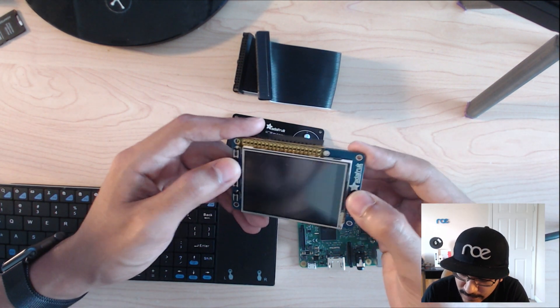Here's the Pi — I'm going to disconnect the power since we safely shut off and plug the Pi TFT into the GPIO headers — just snap it in like that. I still have Ethernet plugged in so I can SSH into it. Make sure the card's still in there. I'll plug in power again and we should be able to see it boot up. We'll get a white screen for a second, which is totally normal, but we should boot in about 30 seconds or so. Now it looks like I do have to rotate the screen, so I'll show you how to do that.